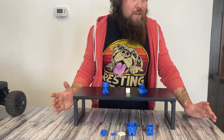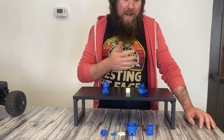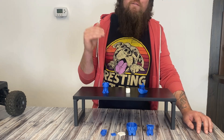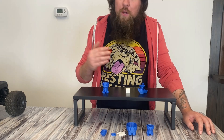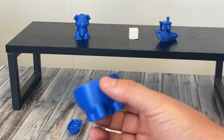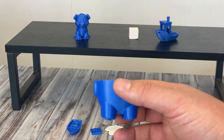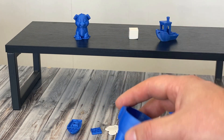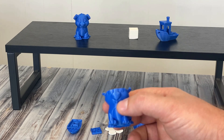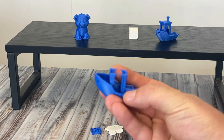Well, that was kind of foolish, wasn't it? In retrospect we really should have taken some time and done a little bit more research to find out about things like bed leveling and adding brims to your 3D prints. We had a few issues with the prints actually sticking to the print bed. But a few late nights and a lot of research online, and we were able to get some really really nice benchmarks. Here's the pig that we started with — this one failed. It actually got pretty far. I'm actually kind of impressed to see how far this got without any bed leveling. It didn't stick to the print bed so it came loose and just shot filament all over. Same thing with our poor puppy — it got pretty far but came loose from the bed. Then we tried to print Benchy the tugboat, and we really dialed in the bed leveling and we were able to get this.